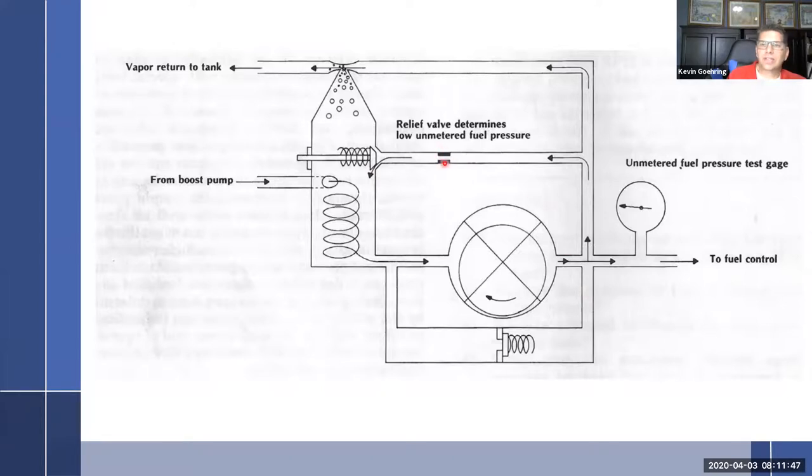And then this is the orifice that I showed you, and it was not adjustable on the one we just looked at, but on all the newer ones, it's just a screw on the side, which I showed you a picture of. So you screw it in and make this smaller. Somebody's got to answer this one: do I get more or less fuel to the engine if this is smaller? More fuel to the engine. More is correct. Yeah.